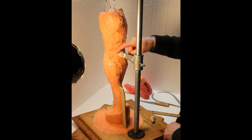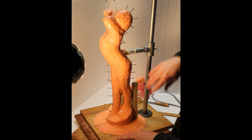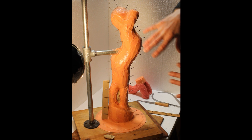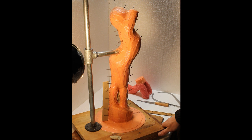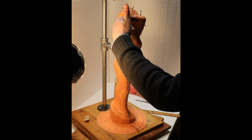This center section where the pipe goes into the sculpture — I have another video called 'Removing the Armature Pipe' that shows how to do that. In the meantime, we're going to work around that area. After we have this all set up, we'll make one mother mold half so it comes off on that side, then take the clay and nails off and make the second half pull off on the other side. My hands suggest how the mold has to come off because of some slight hooks in the arm right there, so I'll put some clay in to help reduce that.